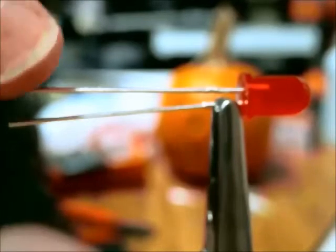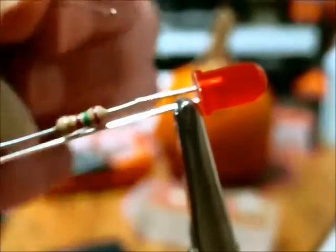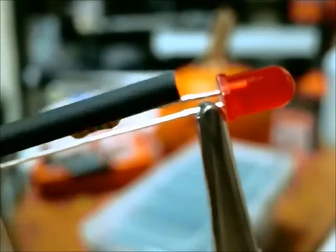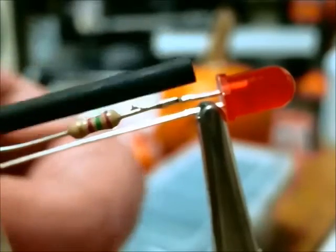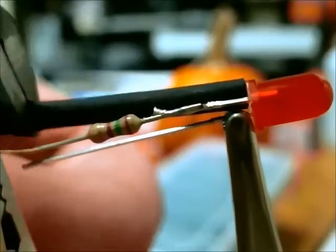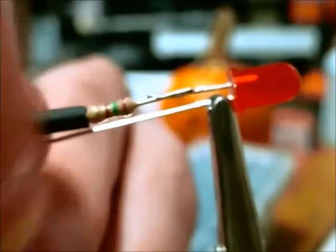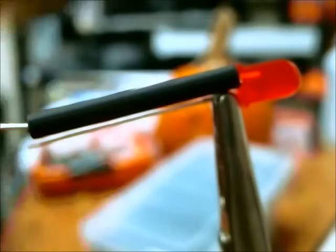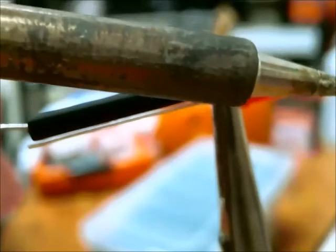What I'm going to do now is solder the resistor right in place of that lead. I also recommend purchasing some heat shrink tubing from Radio Shack — I'll put the part number and link in for you at the bottom. Cut the tubing so that there will be some lead exposure at the bottom of the resistor, then come in with your soldering iron and place it close but do not touch the heat shrink, and gradually it will shrink down to a snug fit over the lead and resistor.